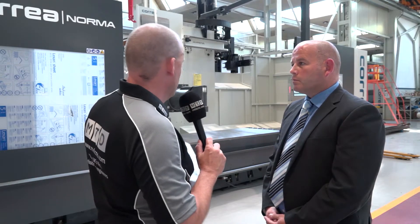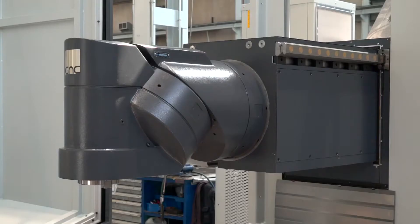If you were to look at a machine as standard, what would it come equipped with — a fixed head for 3-axis machining? This machine comes as standard with a UDG head, which is a 2.5-degree indexing head. The head we've got on here at the moment is a 0.02-degree indexing head.